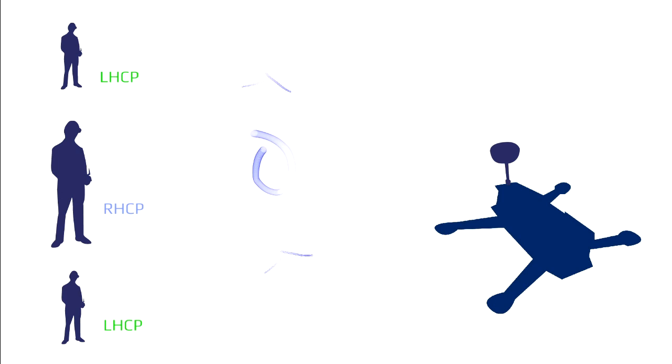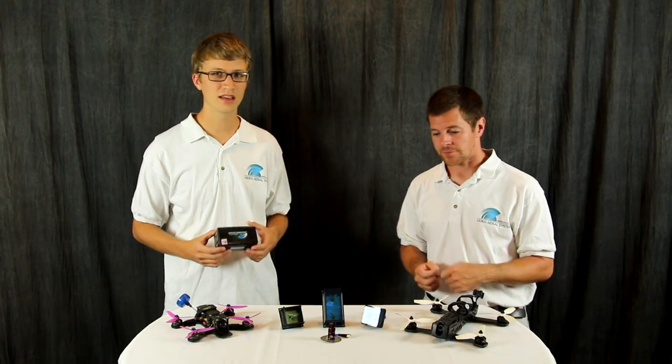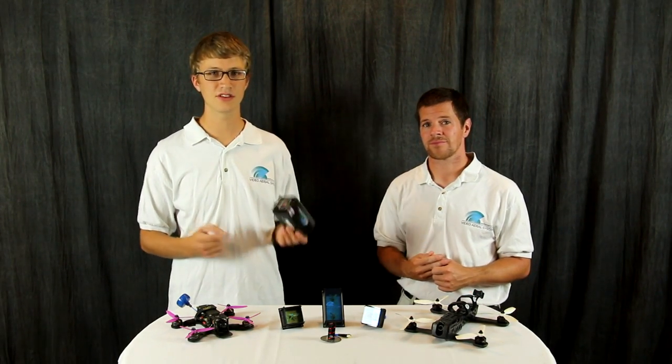This means significantly less interference from other pilots on the track. This table shows the channels and rotations for minimal interference — bands A and E are used and no special channels are needed. This separation and reverse rotation also minimizes the effects of intermodulation distortion. To find the axial ratio, a manufacturer who tests their equipment should have it published. You're going to need a separation of at least 12 dB in the dominant direction — 12 dB more dominant than recessive — which is an axial ratio of 0.6 or greater. If they don't have this published, you can look at their radiation plot.